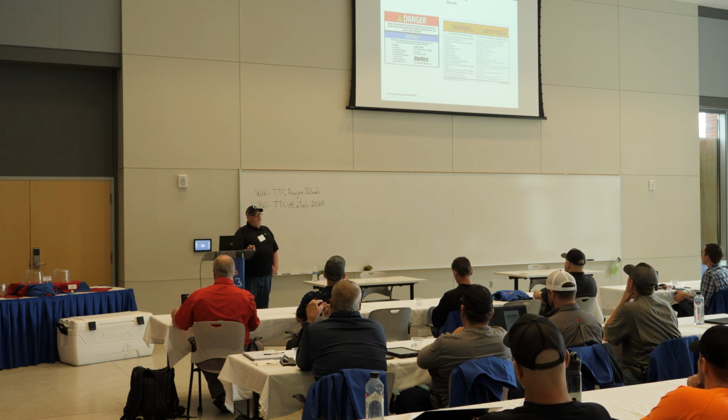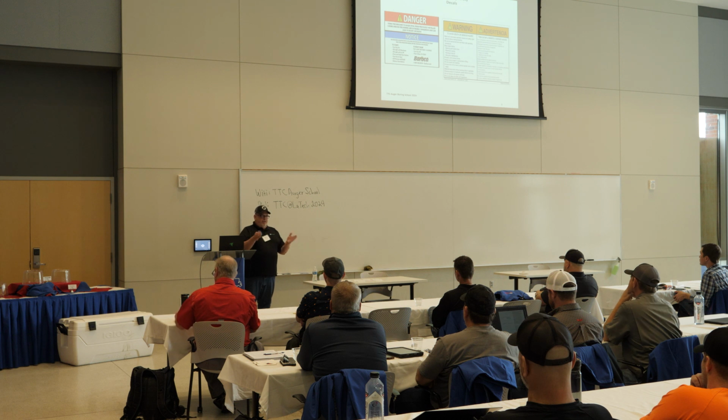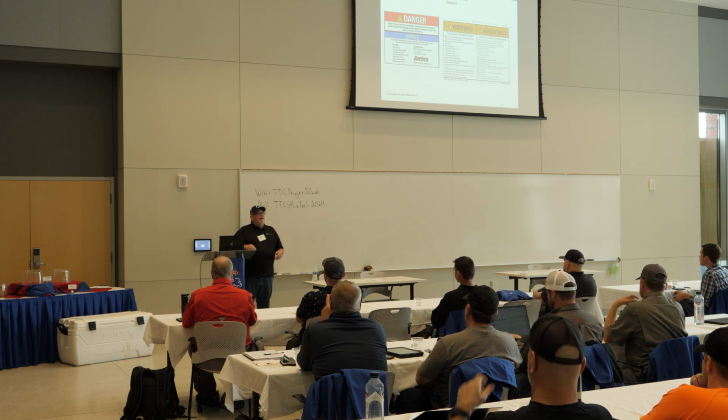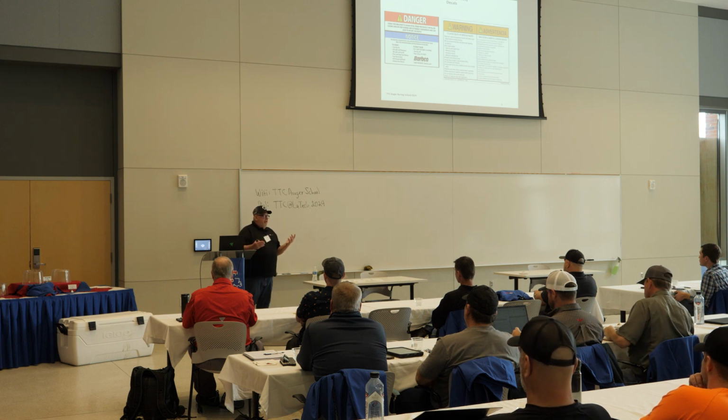No matter what, these machines will flip. We do have tilts on our machines that are supposed to declutch and shut it down. But we've had people set machines up diagonal in the pit because of utilities in the area. And the machine would start to tilt and catch on the pit box, and it doesn't go all the way to shut it down. It has to go a certain angle. So it's still sitting there running, leaning against it, and starts kicking away from the wall. And it can still, with momentum, break it over. So you still have to be cautious of what you're doing.